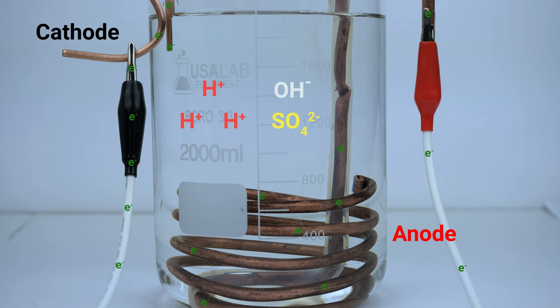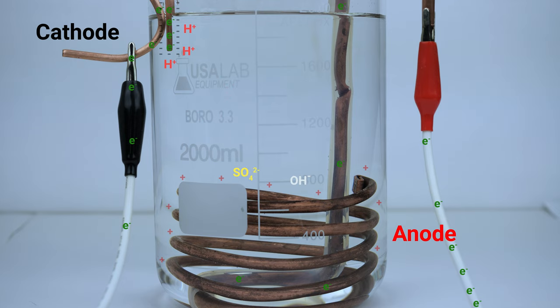When we turn up the voltage, the electrons in the copper will become more concentrated at the cathode, forming a net negative charge. Electrons will migrate away from the anode, so there will be a net positive charge here due to the positively charged protons in the copper metal, which remain immobile. Our mobile ions in solution will begin to migrate to their oppositely charged electrode, positive to negative and negative to positive, so the electrode surface is where our reaction occurs.